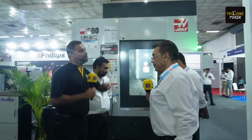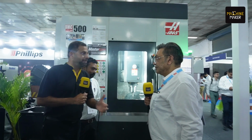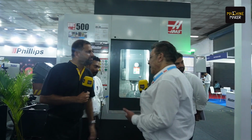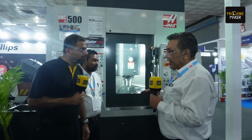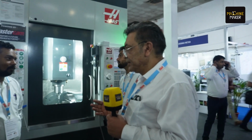So when we are talking about Indian component manufacturers, you deal with a lot of people, right? How will this complexity help Indian manufacturers machine what kind of components? For aerospace, for defense, for medical implant manufacturing, which require a lot of complex parts and complex surfaces to be machined, which is traditionally not possible in the traditional way. It will take a lot of time. Here you can reduce that cycle time. Here you can achieve those tolerances and criticalities with synchronization of all 5 axes.